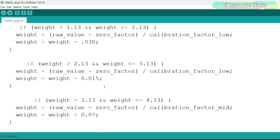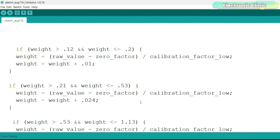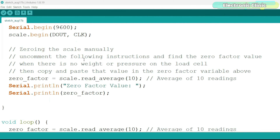To solve this issue I defined two calibration factor values — one for lower weights and another for mid-range weights. Not only that, but I also calibrated the scale from as low as 0.01 grams all the way up to 5 kilograms, covering every level. This was important because in the past when I added small weights like 250 grams or 50 grams on top of 1, 2, 3, 4 or 5 kilograms, the readings would be a bit off. With this new approach, those issues are gone.